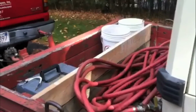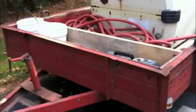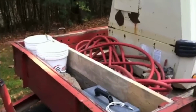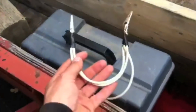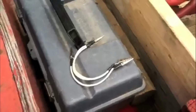So now that we have everything cleaned up, I'll quickly explain to you guys running a blowing out system through the clock instead of through the valves manually. So it's just the same way. You open up your first valve, turn your compressor on, let it run through. You can use a little cheater like we do. It's just a bunch of wires with clips on them. That way you can turn on a zone and clip to other zone terminals and run 2, 3, 4 zones at a time.